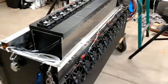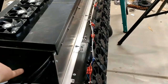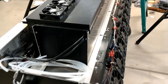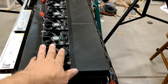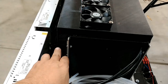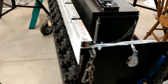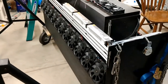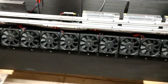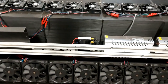This is the beast. Up on the top here we have the water tank, which is also where the fog is generated. It holds the water, and these are the cables that go to the three foggers inside. They generate the fog that floats in this chamber. These fans on top push air through, and the air displaces and pushes the fog out, up and around this back portion, then down into the body of the fog screen, which combines it in the fog chamber and basically collimates it — funnels it down into the honeycomb. It's actually a pretty simple setup. The most complex part is probably just getting laminar airflow, which is not the easiest thing.